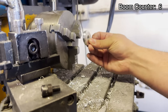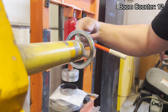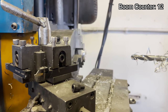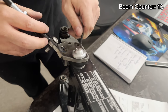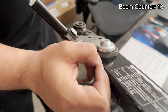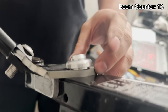All right, we're going to put this in the chuck — it has a little step in the back. A lot of booms in this video — Michael Bay, manual labor right here. Got that bored out. So we got one of our hardware bolts right here from flpparts.com. That's very nice. One thing I see right away that would look better is if I brought this edge to kind of follow the contour of that washer. I'll modify that on my drawing so everything looks like it was designed for this rather than pulled off another project to make it work.